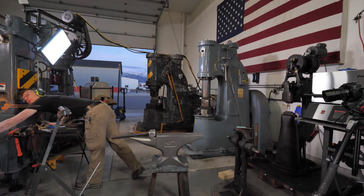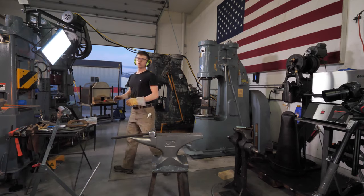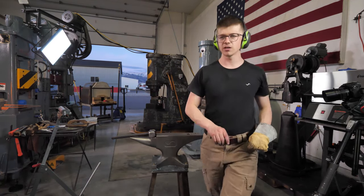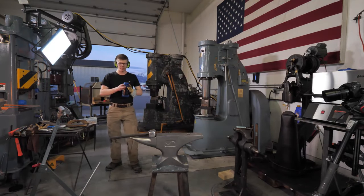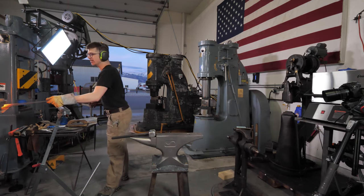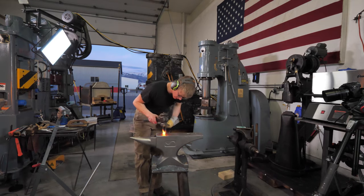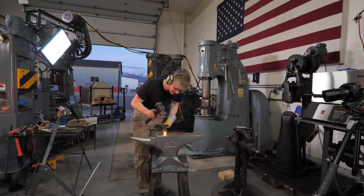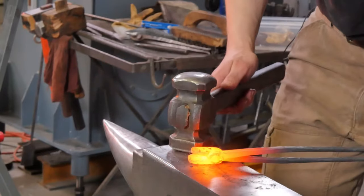To put into perspective, when working off of one of those big propane tanks that we use, is it a 100-gallon propane tank? Thank you so much. 100-pound propane tank, maybe? We get a few days of work out of one of those. You know, so we'd change two. In a week's forging, we'd go through two bottles pretty easily. Which means that in a week's forging, on propane, depending on how expensive it is, where you buy it, with a forge this size, running it all the time for a week, like we sometimes do, you might spend $120, something like that.